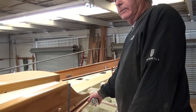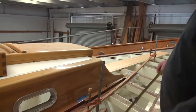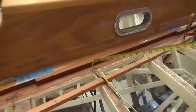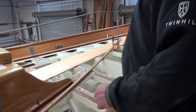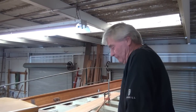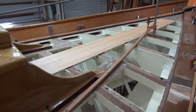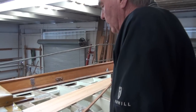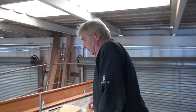This batten here — we were figuring out how we're going to do our nibs. This measurement, 13 and 3 quarters, is constant. And by golly, the other side is the same — 13 and 3 quarters. It's the only spot on the boat that's the same so far that we've found. So if you create the same angle and run it right along there and meet the nibs at an equal place up at the top, it just happens to fall back perfectly. Good job, Italian boat builders.